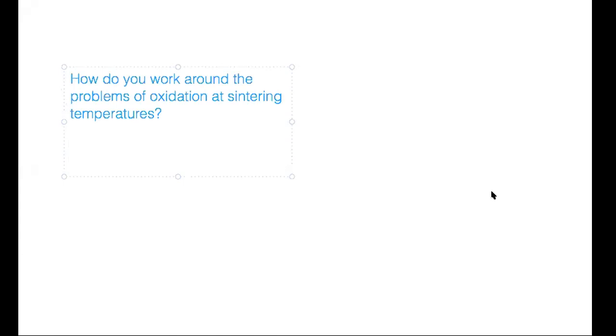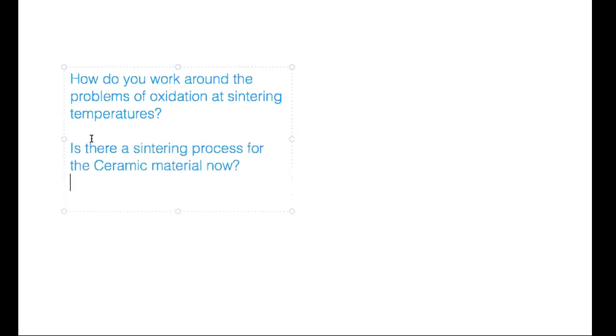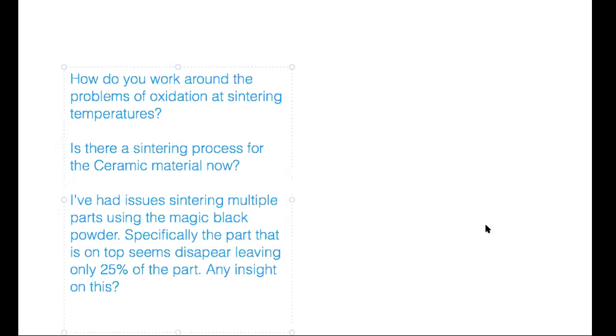When we first started, we were involved with vacuum kilns and also did some work with the Virtual Foundry's magic black powder to address oxidation. We now sinter everything, including the stainless steels, in what I'd call an open environment. Our crucible is filled with a refractory — the part is buried in aluminum oxide — and we use coconut shell carbon to address the issue of oxidation. We put the coconut shell carbon on top, and as it burns it absorbs the oxygen from the chamber. This is a common technique in the metal clay industry. Once we started doing that, things really took off.